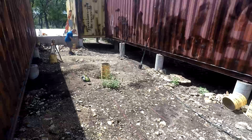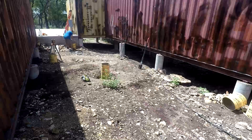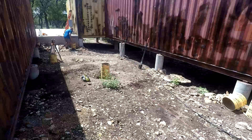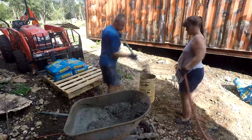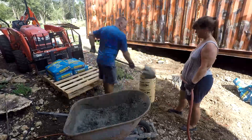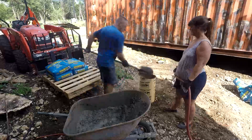The other two were sitting on a rock bed, so we went down to the rock bed and set them. We shoot the line to make sure they're all nice and straight, and then we start pouring in the concrete. Instead of using the electric cement mixer, we just did it by hand — about eight or nine bags of concrete, very straightforward.